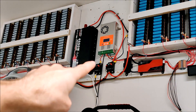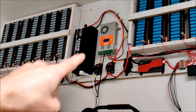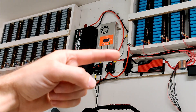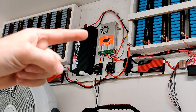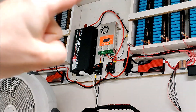The incoming solar goes to my MakeSkyBlue solar charge controller. The charge controller's job is to normalize the incoming voltage — your solar panel voltage will constantly go up and down as clouds move through the sky, fluctuating quite a lot. The solar charge controller normalizes the incoming voltage and puts out a consistent voltage for your batteries. This is a 29.4-volt lithium-ion power wall and the charge controller is programmed to output 29.2 volts to charge it.